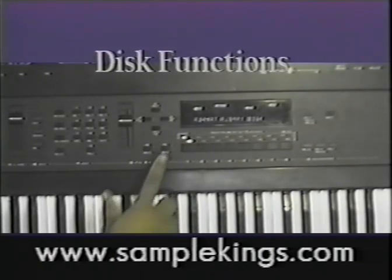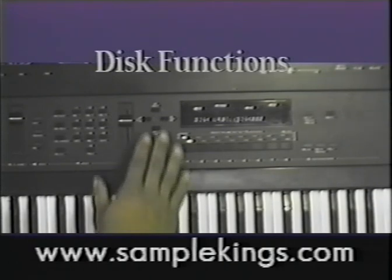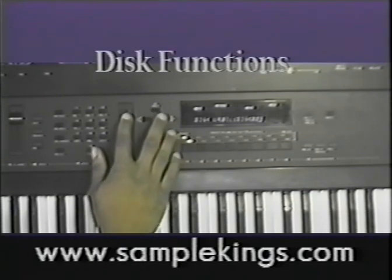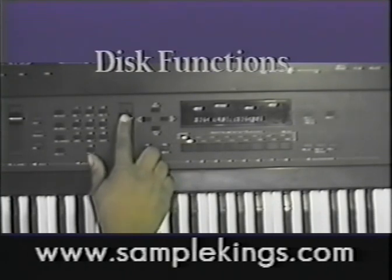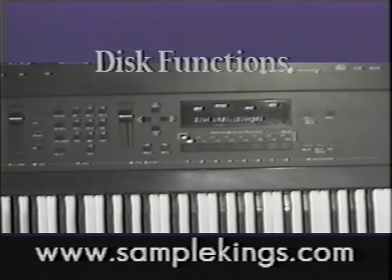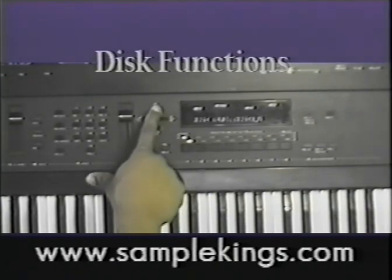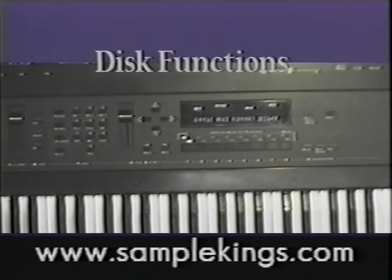Press Enter and the display will read Disk Label Disk 000. Use the data slider and arrow buttons to give the disk a unique name which you can use to identify that disk. This is very important. The EPS will ask you for this disk name if an instrument or song on the disk is used in a bank. Also, make sure you write the disk label on the outside of the disk after you are done formatting it. Press Enter Yes and the display will read Erase and Format Disk.